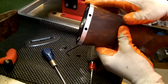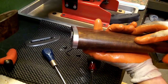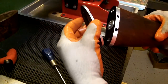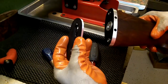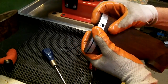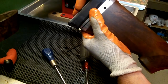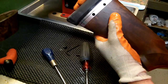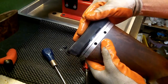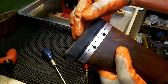Okay, this looks good. So we knocked that top bump off and it fits super. We're perfect. So we're not going to do any more grinding on the adjustable plate. Now our next step is going to be to scribe this pad on from the plate and do our grinding. This pad's frozen. You know how I like to freeze my pads. So we get the frozen pad. We're going to go ahead and scribe it, and then we're going to grind the pad down.